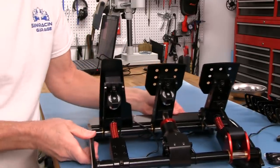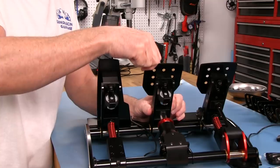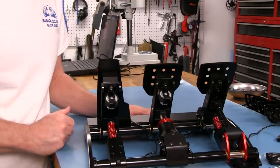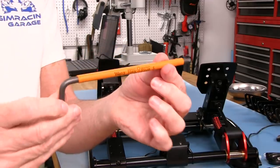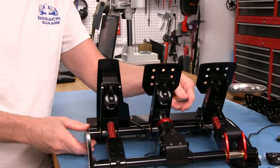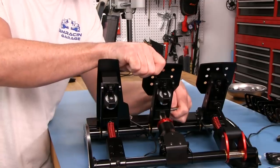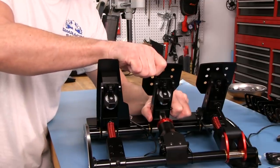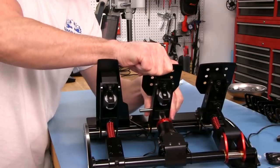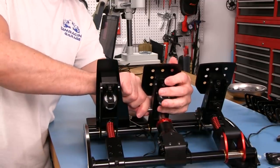Pushing the rod out is a bit of a process, but not too bad. You can push it a little bit with your finger and sometimes shake it back and forth to relieve pressure. I can only push it about an eighth of an inch with my finger, so I need something to help - in this case, a 5mm hex wrench. I'm going to push the rod from this side out to me, just wiggling a little bit, taking pressure on and off. And there we go - it's starting to move. Got it out.